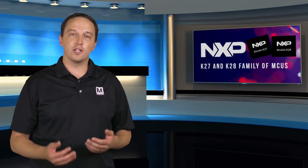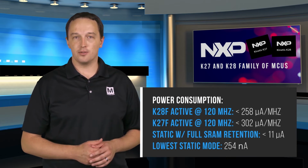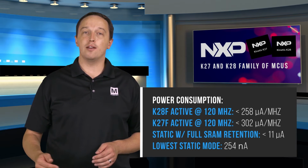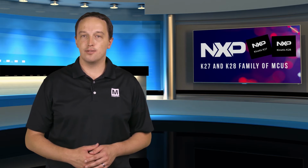The inclusion of 1 MB of SRAM is up to 4 times more SRAM than other MCUs, offering improved performance and enabling rich display capabilities, improved UIs, and more complex apps. Power consumption is also lower using SRAM, and low power consumption is improved with UARTs and timers that operate in very low power modes to maximize efficiency and extend battery life.